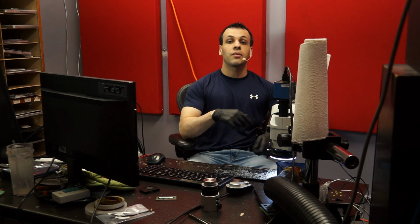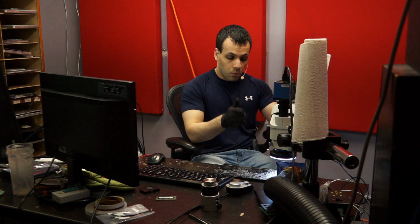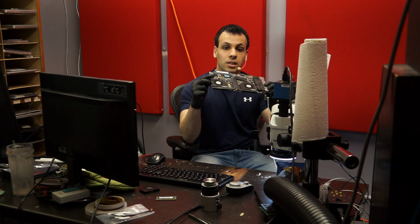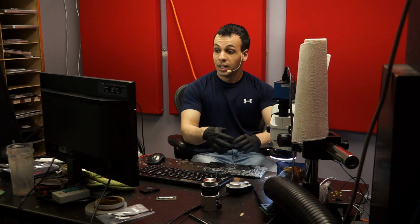The first thing that you have to do is go through the list of power rails. It's the first thing that I do when I have a no power issue, so that I can try to figure out which rails are missing and then go from there so I know where to look. Because again, this is a big board. There's a lot of stuff on this board. I don't want to test every single component. That is a complete and utter waste of time.